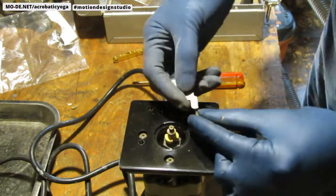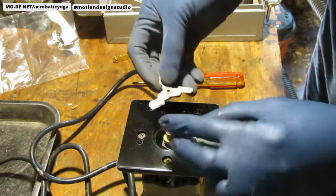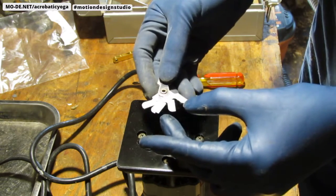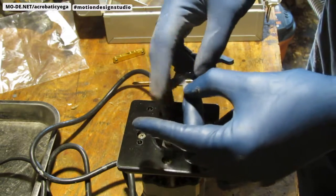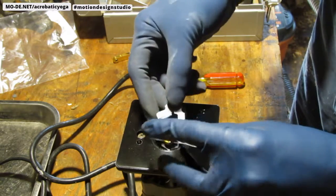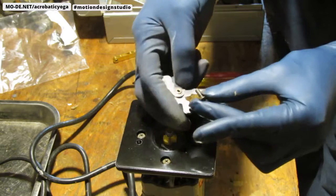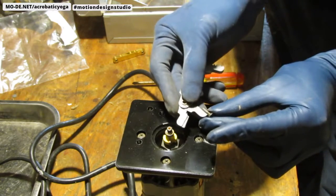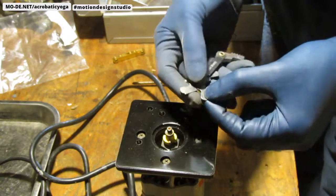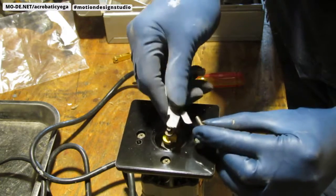All right. So I'm just trying to match the teeth up with this. That's still too large, so I'm going to go down in size. That's 20. Let's see, 24. That's 24 teeth per inch. That's what those numbers mean. Let's get in a little closer. Nope, let's go to 27. Nope. How about 28? Hope you can see this. I'm not wasting your time or mine. Ah, 28's looking good.